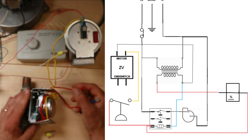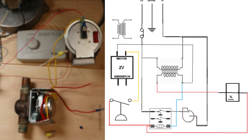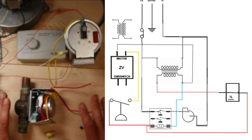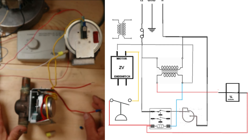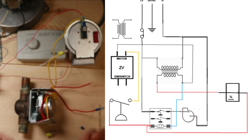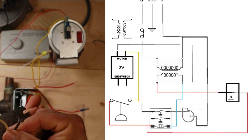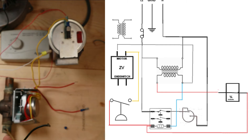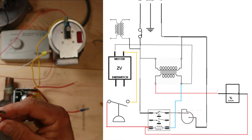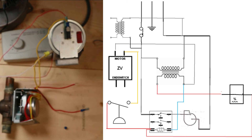Now we're ready to hook up something else to this circuit, and we need to bring in power from somewhere, so we're going to hook up a second transformer. We don't want to take too much power off of one transformer when we already have a relay coil and a motor on there - we don't want to keep adding stuff and overload it, because then parts won't start working due to insufficient power. So we're going to hook these black and white wires up to the same wires feeding the first transformer, splitting off again from that 110 volts coming in from our switch.